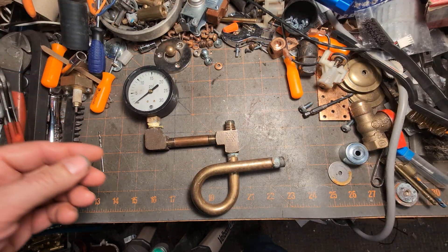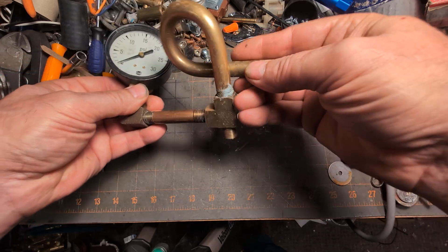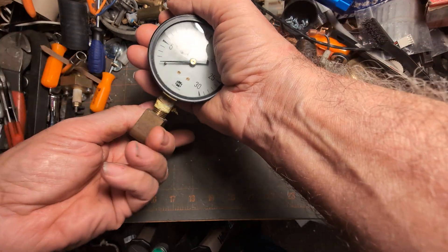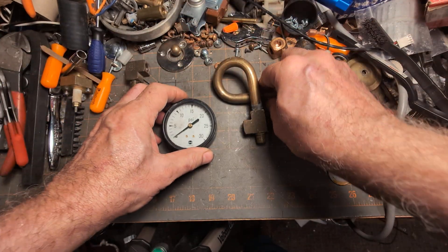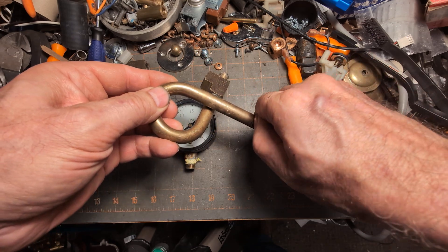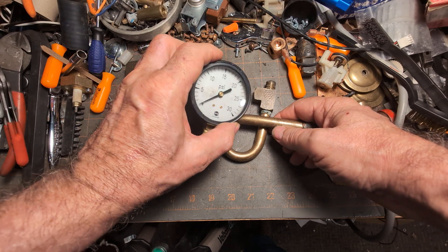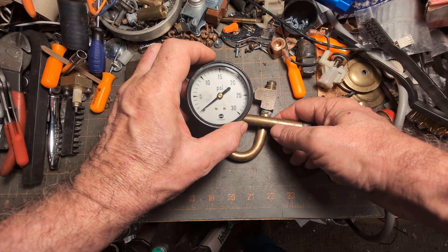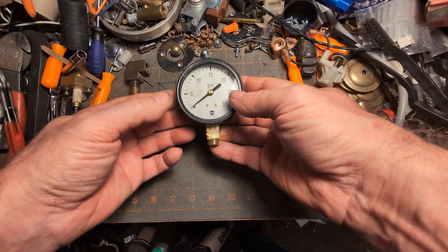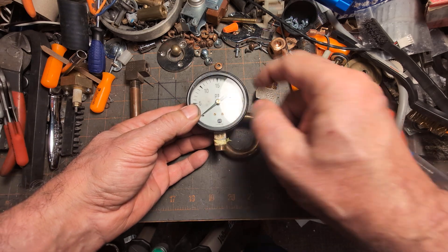We're not going to be talking about ordinary steam siphons — we're going to focus on a hidden type of steam siphon which could probably cause problems. If this becomes clogged, the boiler pressure is not under any control. The gauge doesn't read much of anything in proper situations, because it's several times more than the actual operating pressure of the steam boiler.